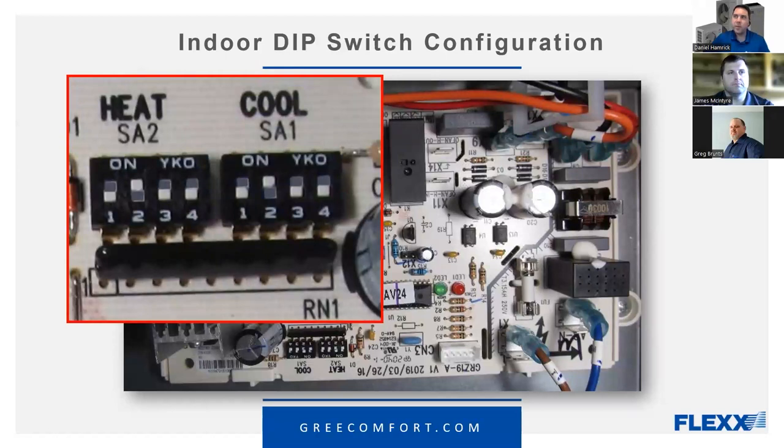There's no factory setting — I've done technical service for over 12 years and I've heard that same saying over and over again: 'It was factory set.' No — nothing's factory set. You have to make sure the dip switches are set for the installation you're doing, then verify the system is performing the way it was intended. It enables you to dial it in to meet the needs of the space you're trying to cool or heat.